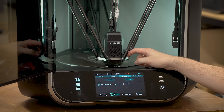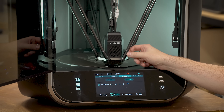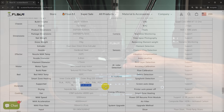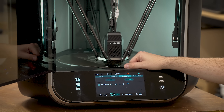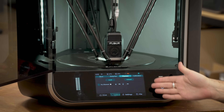Lastly, I do a lot of abrasive filament and I like all my printers to be able to print abrasive filament. This is listed as being able to do that. It does not have a hardened hot end — it cannot actually print abrasive without wearing out. It has a CHT-type thing in there, a knockoff of course, and it is not hardened so this will wear out if you use it with abrasive. So once again, they are basically lying to you saying that it can be used with abrasives, because it really shouldn't be.